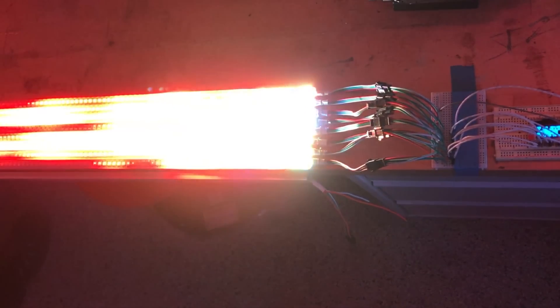You have to be careful not to draw too much power. This only works because we're using a 5-volt strip with a 5-volt USB pin — if you had a 12-volt strip you would definitely not want to connect it to the 5-volt module, and in that case you would just have ground and data with no power connection between the two. NightDriver also supports wiring each box with its own strand connected to a separate pin on its own data wire, but that's a complication we'll have to wait for another day and another episode.